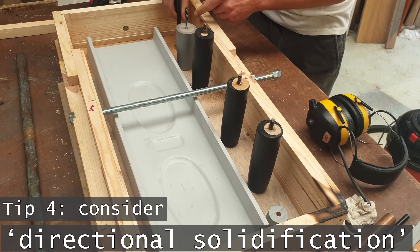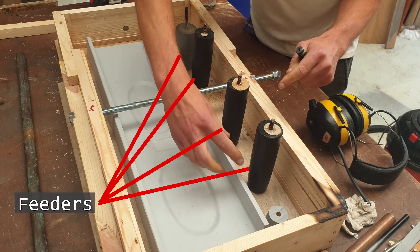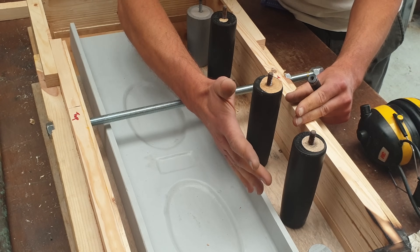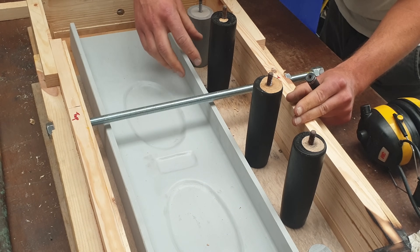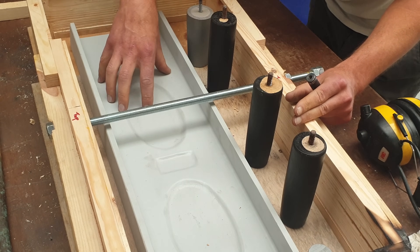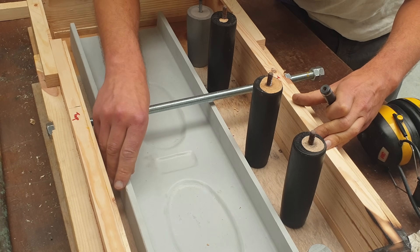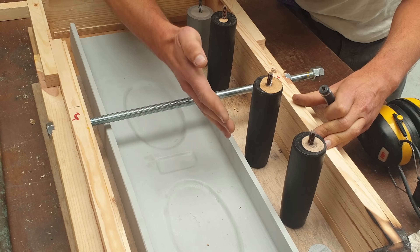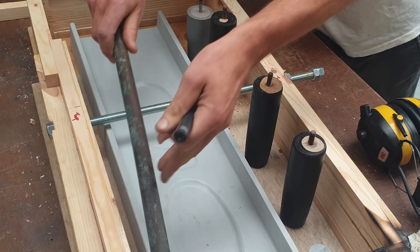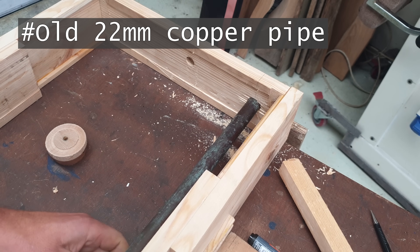Here's the thinking. The aluminium is going to come down the pouring basin and sprue here. It'll run along these feeders and gate in at four different places into the void. We want it freezing from this side to this edge so that the feeders are the last things to solidify, feeding aluminium into the shrinking pattern. Hopefully that'll tend to happen anyway because the aluminium is being fed in from this direction, so the first aluminium in will be on this side and will have had the most time to cool as it contacts the green sand. But to make sure, we want to add in a little chill.